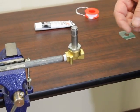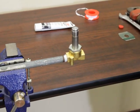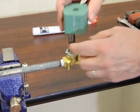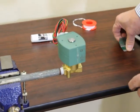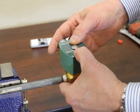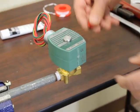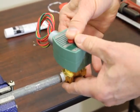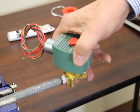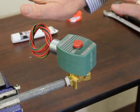We're going to go ahead and pretend that we've piped it up on both ends and we're ready for final installation. We're going to put the spring back on, put the coil back on, and put the name plate into place — depress it a little bit and slide it in so it locks. Then just to keep it presentable, we'll put the red cap back on, but remember that red cap doesn't do anything but sit there and look red. After you put the coil on, you can wire it up and you're done.